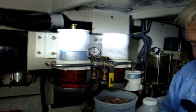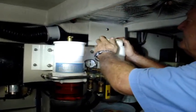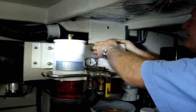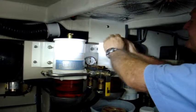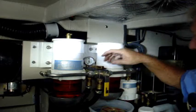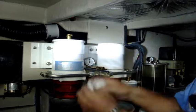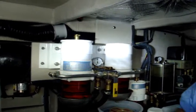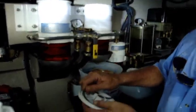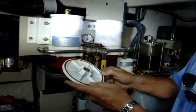Now I'll pull my other filter — I've already got my other filter out, ready to go back in. Don't just go shoving it in there; take your time with it. It carried some fuel with it, but we're going to have to use our jug of diesel to fill it back up. Now, you notice I told you about the little bag that's got the O-rings in it. Open it up. Here's your gasket — it's just going to fit right inside there. It's a rubber seal.